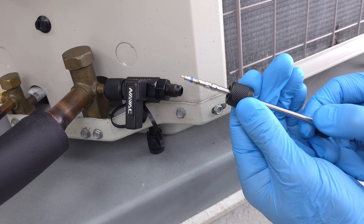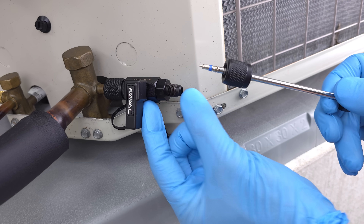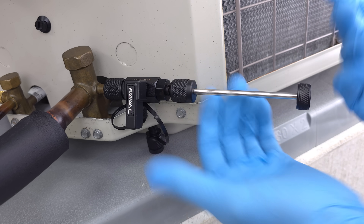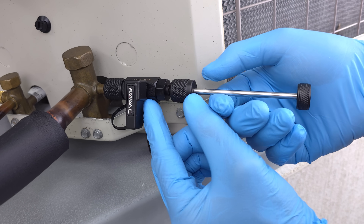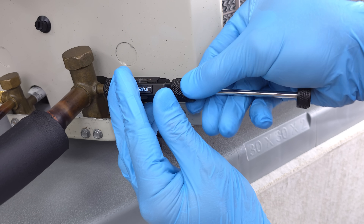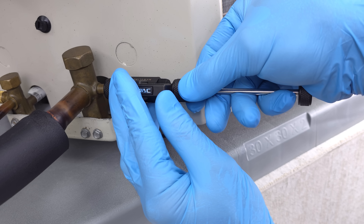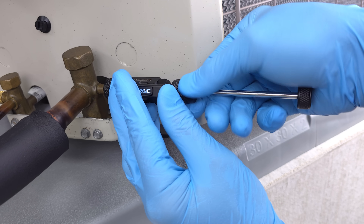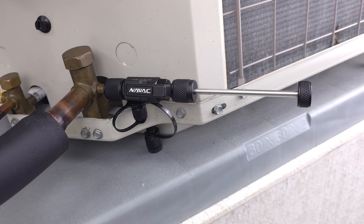The whole point now is to pull all the way back because the valve is in the off position. We only have this much room — we're going to slip this in and lightly snug it. Next, we're going to open this up and purge the air out of this little section. We're going to open this up and back this up just a little bit. You'll hear a little hissing noise — we're just trying to purge any air out of that section.